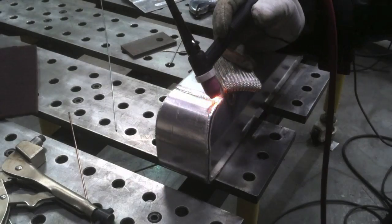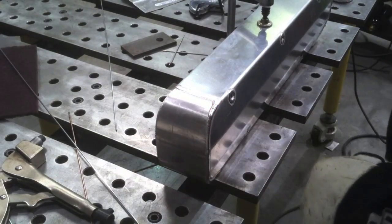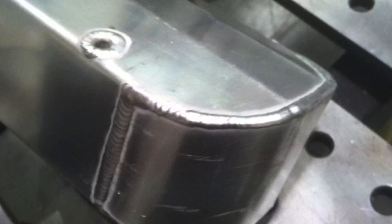I've tapered the electrode a little bit here. At one point I started out with 120 Hz, and then I wound up turning it up to 150 Hz, just messing around with the frequency. It actually seemed to improve the bead profile a little bit by focusing the arc cone for some of these joints, keeping the bead pretty small while still getting good full penetration where it's needed. Another shot of the same type of joint with a better fit-up — see, it's not keyhol-ing out. The better the fit-up, the better the weld. No matter how skillful you are at welding, if you've got a bad fit, your weld's not going to be as good.